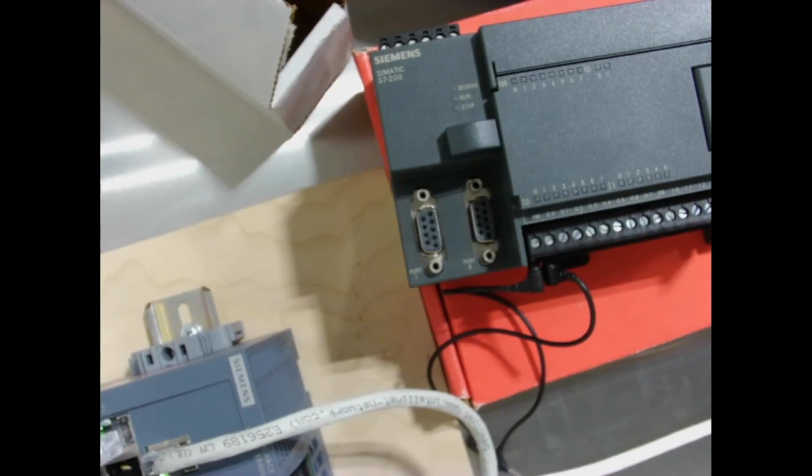All right. And then we have layer 1, which is our physical. We have 3 different options. We have standard twisted pair, which is our RS-485. Again, that'd be Profibus. We also have fiber optic options. And then you also have a Manchester Bus Power, or MBP, and this has safety enhanced systems for explosive environments.